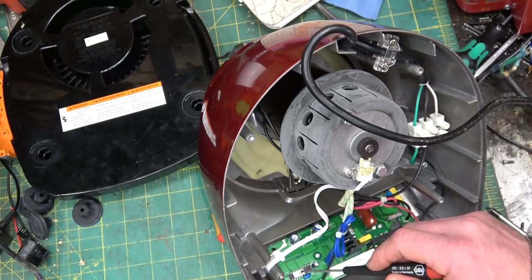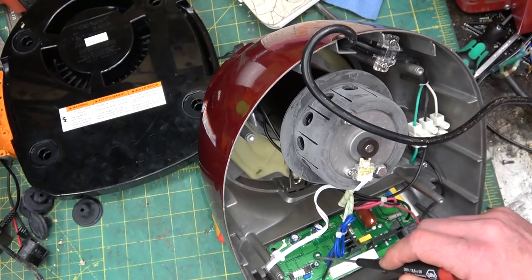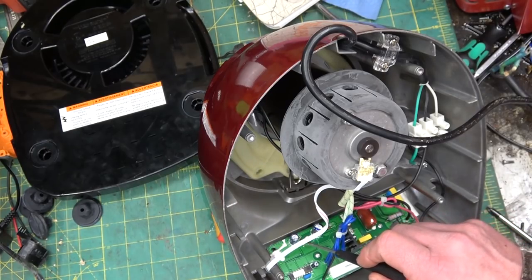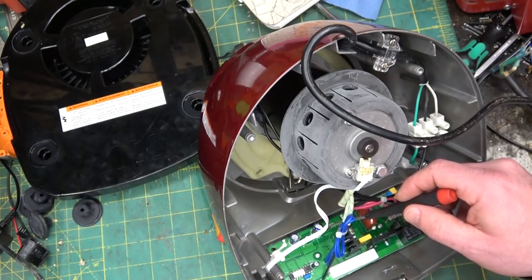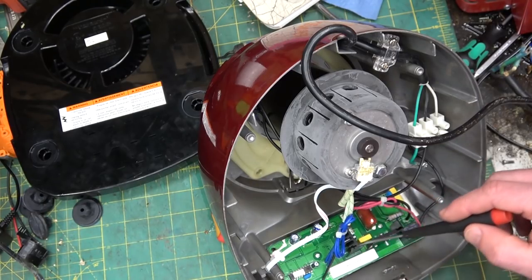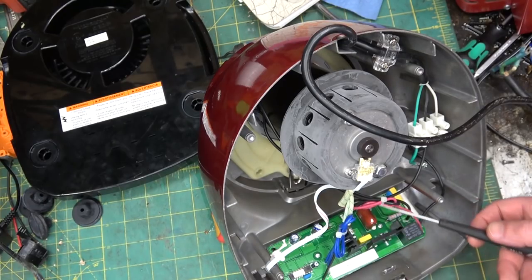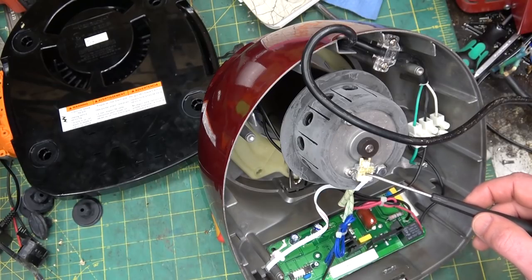Here's the brains of the operation — a DIP chip. On the far side of the board there would be some tactile switches, small capacitors for noise suppression, and a couple of little diodes. There's also R1, which is a shunt resistor in order for this guy to measure how much current is going to the motor. Really not that much to it.